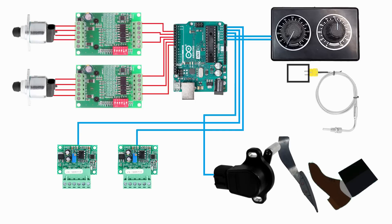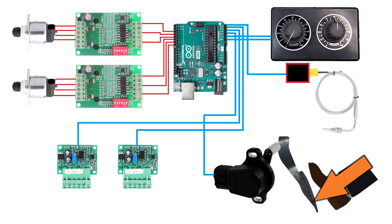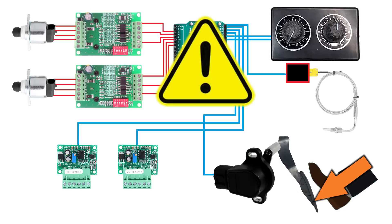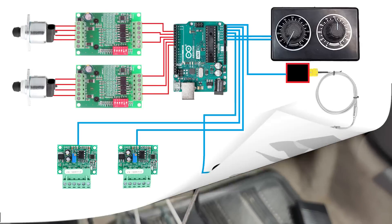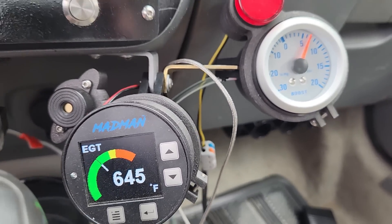The next sensor is going to monitor the exhaust gas temperatures. Initially, we want this sensor to keep track of EGT, and we'll write code so the data from this sensor can directly command the fuel rack limiter to push the rack back to a safe limit if we exceed the design limits of the engine. Right now it's very possible to roast this engine in about a minute if the accelerator is held to the floor too long. We're going to actively protect it with a computer, and as a backup we'll still have the alarm built into the madman multi-gauge — because never trust a computer.